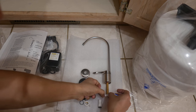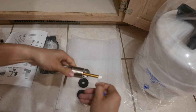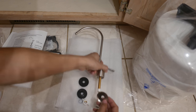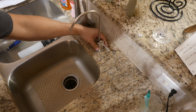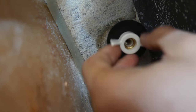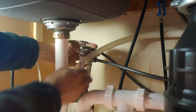So right here, I'm going to install the faucet. I am wrapping Teflon tape around the threads. You only need about 5 to 10 wraps around the threads. And so next I'm installing a rubber washer. And after I put the faucet through the hole, as you can see in the next video, I am now installing another rubber washer underneath it, and I'm tying it down with a lock nut or wing nut, basically.